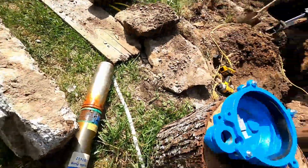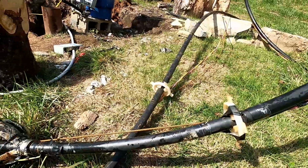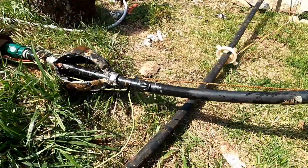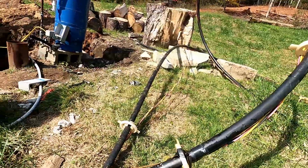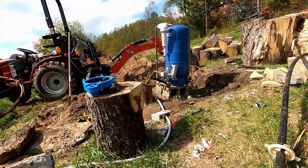So here's why I'm doing this. Screen wire right here. See it? I'm going to add a wire here and ground it. Run it up with the other wires and stick the pump back in the hole. But I should probably do my pitless adapter first.